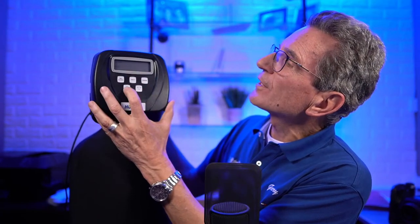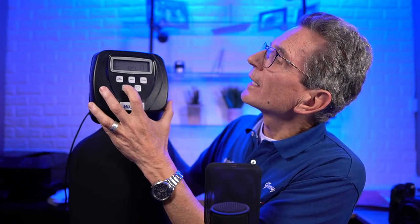And then down here it says normal. So what that means is it's going to calculate reserve capacity, and it's going to make sure that you don't exceed that reserve capacity. So it's going to regen in time so that you always have softened water. Okay, so you can also change this to different settings on zero. So a twin tank water softener would be set on zero, which means that once the one tank has been exhausted, then it's going to switch over to the other tank. So with a single tank water softener, you don't set it to on zero. You have to have that reserve capacity. But that's why a dual tank is more efficient than a single tank water softener. All right, so we'll go next.